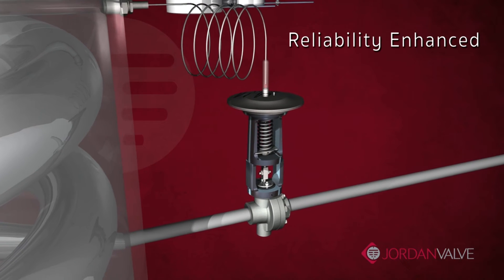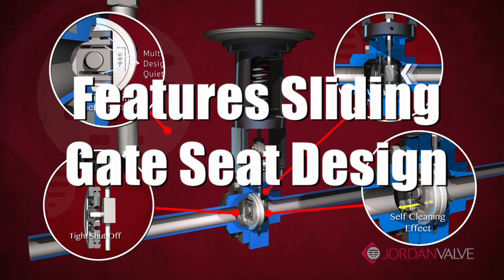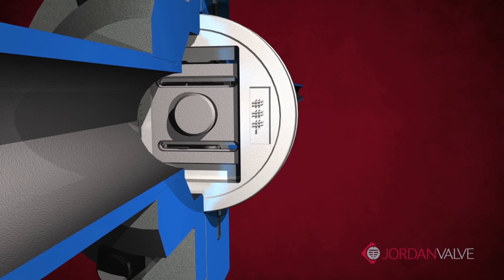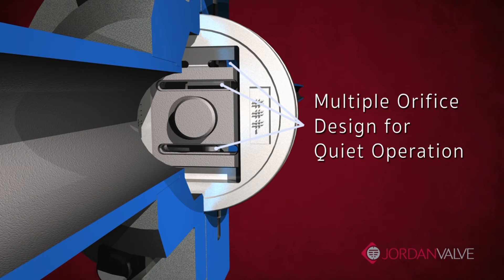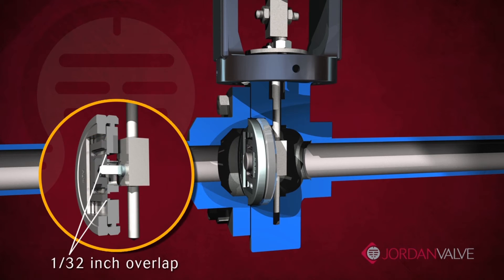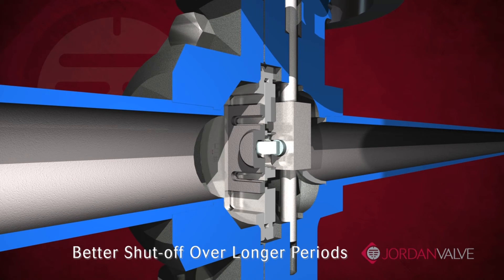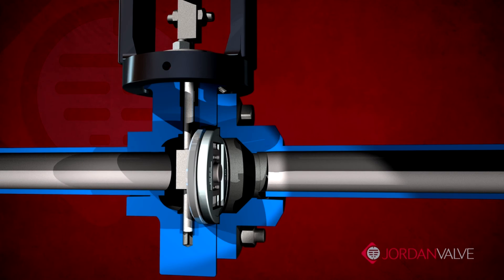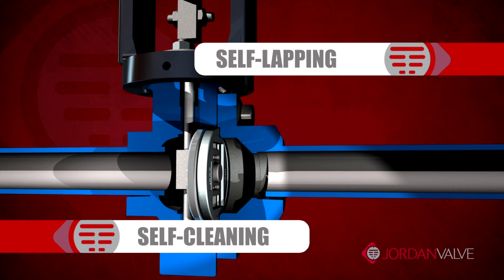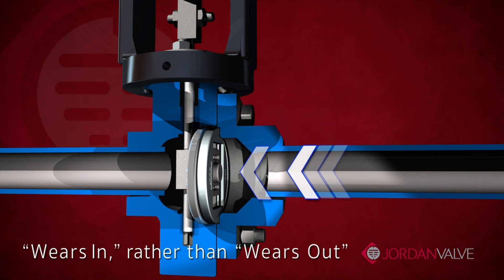Reliability is enhanced and regulator maintenance is minimized. Additional Mark 80 advantages include the sliding gate seat. Benefits include quieter operation, which is maintained by the multiple orifices in both the plate and disk that dissipate flow stream. Tight shut-off: each orifice of the gate is engineered with a 1/32-inch overlap with the plate orifice, creating an area of closure and not a line of closure. This area of closure ensures better shut-off over longer periods of operation. The sliding gate is self-cleaning and self-lapping. Deposits are sheared off as the disk moves across the plate, and sliding gate seats wear in instead of wearing out over time.